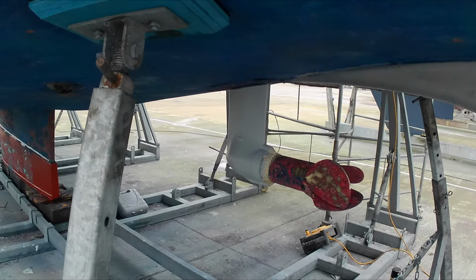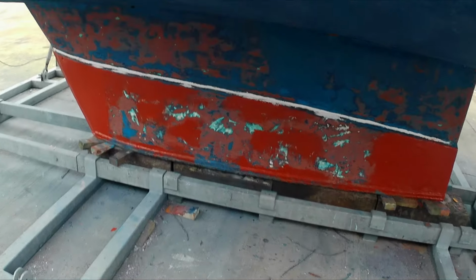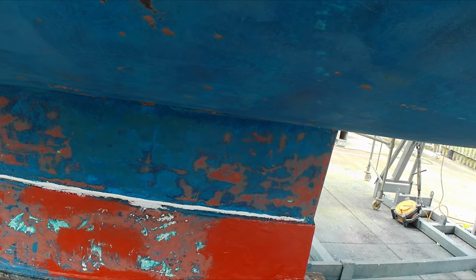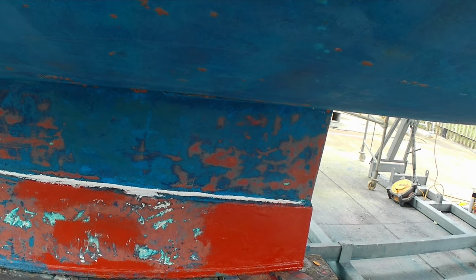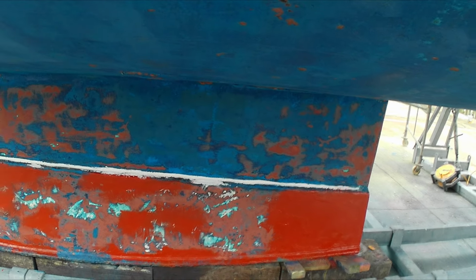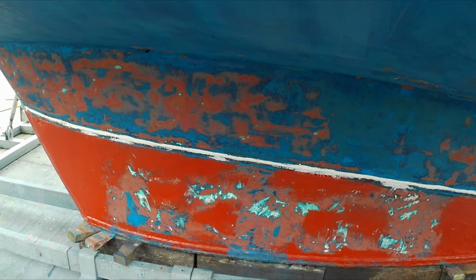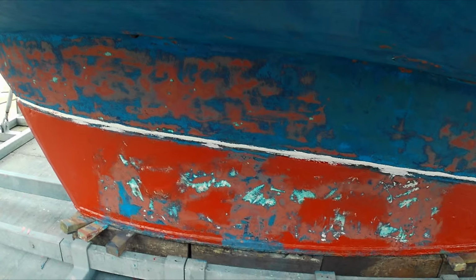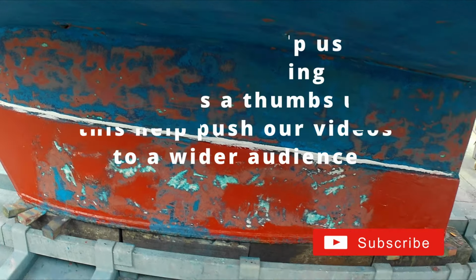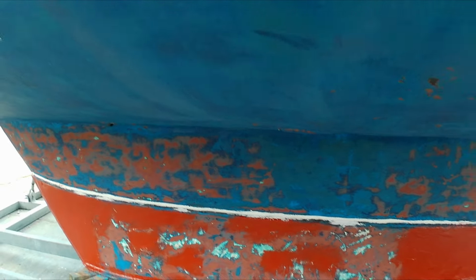Painted the sail drive with Interlux 33 onto the keel. Adrian cut away the seal at the top, got back to where it was sealed in, the seal was good, and also found one or two leak areas on that seal, and so that's now been resealed up with Sikaflex 291i. That's expensive stuff, but it needed it. So I've done all that, done both sides there.